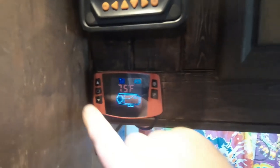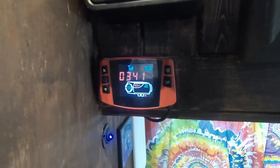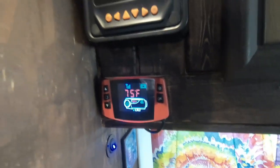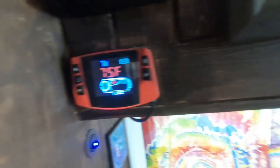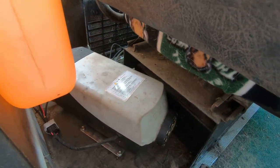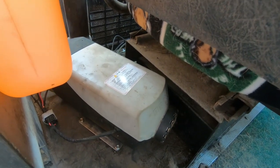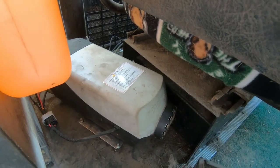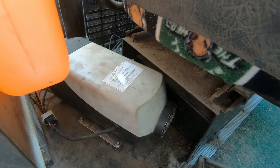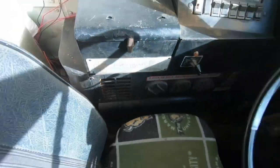We will give this a test fire here. We're not going to let it run for long because it's hot out there, but you always want to make sure these run at least 30 minutes to get all the diesel out of the chamber. I haven't set the clock yet this year, so that's on. The way these work is the glow plug will heat the chamber up in there, and once the chamber's up to temperature it'll actually turn on the pump and start pumping the diesel fuel to it. That is the fuel pump — I don't know if you can hear that or not.